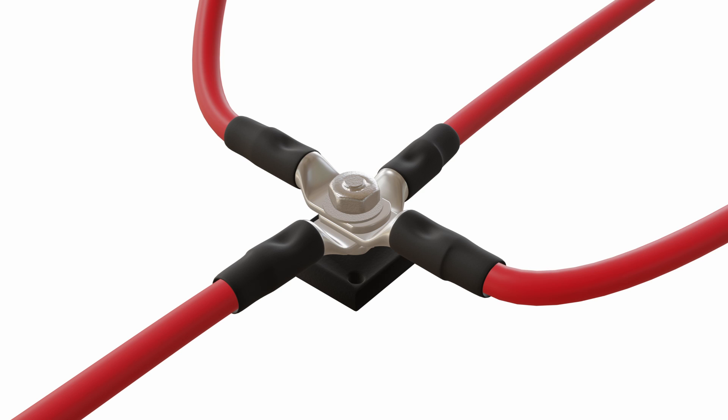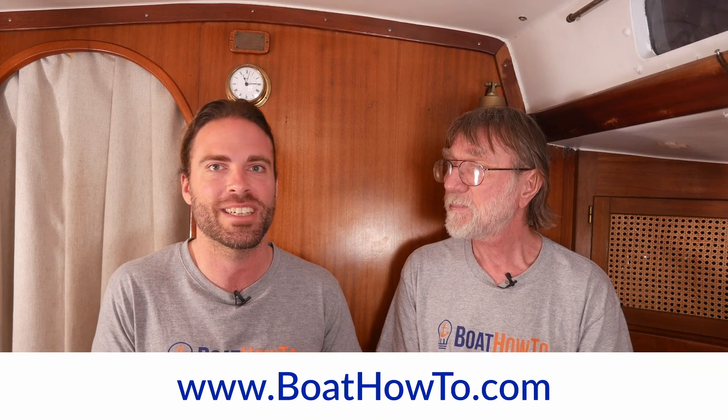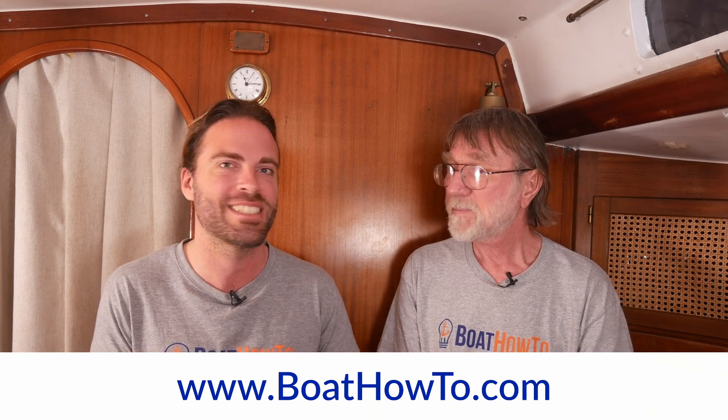Well, that's some interesting insights. So in case you're rewiring your boat, you should definitely do that. All you need extra is one bus bar for each post. If it's up to three batteries, you're allowed four conductors to a single post — three batteries and then the conductor out to the house systems, that's four. But if you've got more than three batteries you're going to need a bus bar, so that we don't stack up the conductors on a single post. Even so, it sounds like a small investment for a significant improvement in battery life, so we definitely recommend that. If you want to learn more about how you can parallel or series-parallel batteries, check out our Boat Electrics 101 course at BoatHowTo, where we talk a lot about this and other ways to increase the lifespan of your batteries. Check that out, and see you soon.